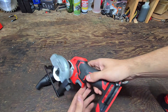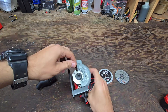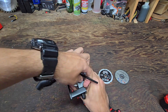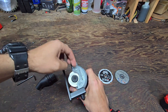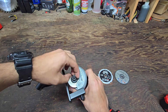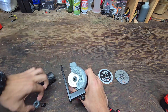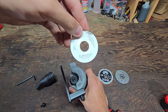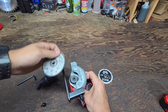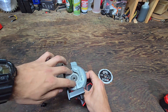Let's pop a blade in — it comes with an included hex key, which is really nice because a lot of times you're out looking for the right one and can never find it. This is reverse threaded, so you tighten it to loosen it, which is very trippy. Make sure you don't do it the wrong way or you could strip it out. The card says to remove the card and assemble the blade between the inner washer and outer washer — doesn't even mention it's reverse threaded. Let's get the metal cutting blade on here since we're using this for a welding project on the truck.